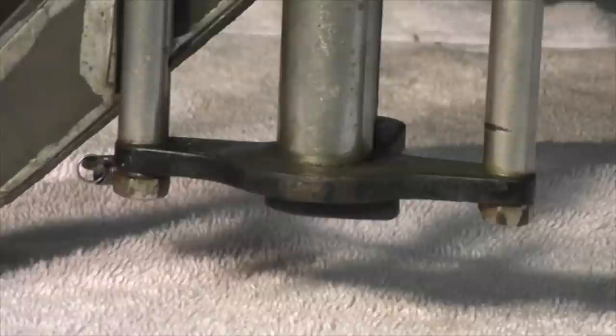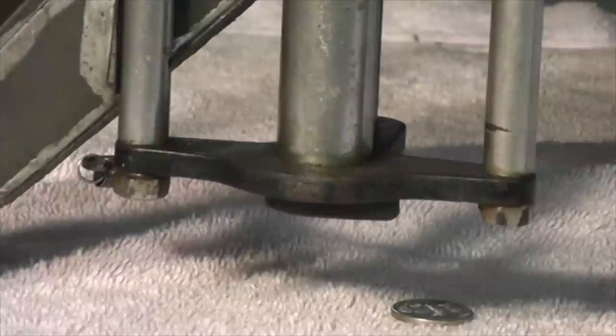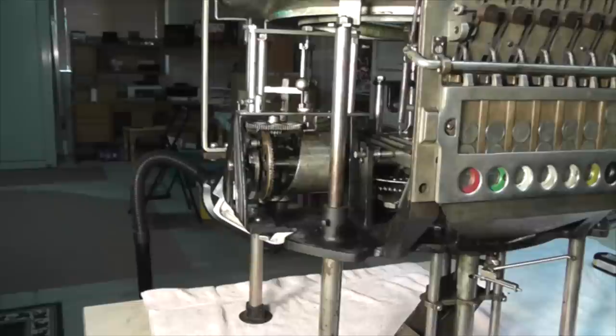Stop the wheel on yellow and hit the ball detection lever. And you can see that yellow pays out 20 cents, which it activated twice to kick out two nickels each time. So here's a shot from the left side of the mechanism as you're looking at it.